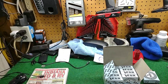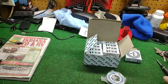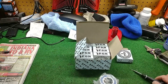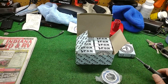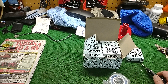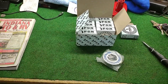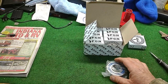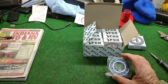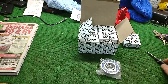If you put your grease zerks in, you won't have that issue and you'll get a lot longer life out of those bearings. Like I said, my Simplicities all had grease zerks from the factory and I've never had a bearing issue on those decks — got a lot of hours on them. Without greasing, the grease eventually works out of the sealed bearings and they don't last long.